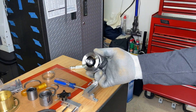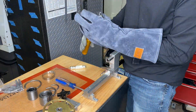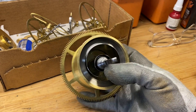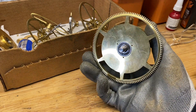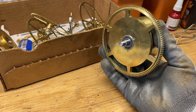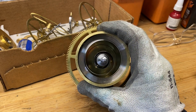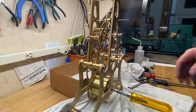We've got the spring captured now and we've got to get it inside the barrel. You can see why I don't like that operation — it's not easy. We've got the spring loaded in and didn't damage the great wheel. I got a couple of marks on it when it released unintentionally, but just got lucky — those will clean right up. We'll put this main wheel together, plant it in the clock, and see how it looks. Again, you've got to treat these springs with a lot of respect because they can be dangerous.